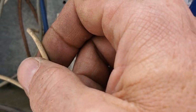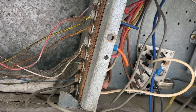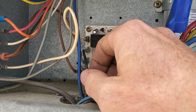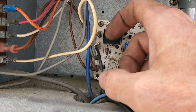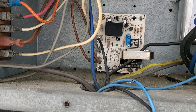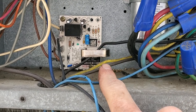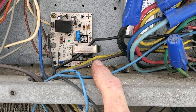So again, you have your white wire going to X, which on most Carrier units I work on goes to nothing — you could remove it. You have your black wire for the pressure switches, your gray wire which is your incoming 24 volts, and your brown wire which is your common. If you shut the power off and turn it back on and everything starts working, this board is probably why. De-energizing the board is the only way to reset it — de-energize it and re-energize it and it'll start working.